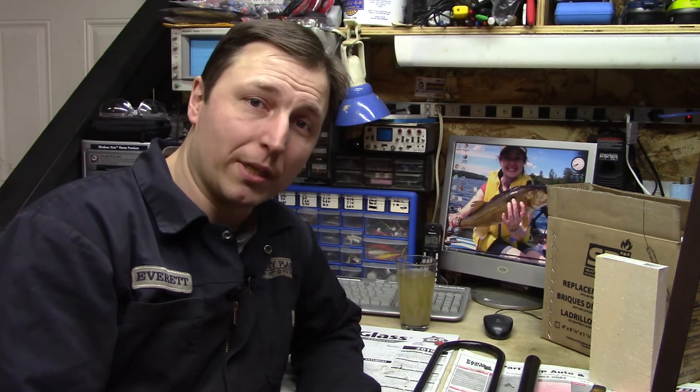I cut them apart to get the rivets and stuff out for the hinges. I've heard various theories of what they're made of. There's one place in the states, apparently down the east coast, that takes and re-rolls old railroad track, so in that case it'd probably be medium carbon steel. What we're going to do is cut sample pieces of each and harden them. Some pieces will be tempered in a kitchen oven, and we'll see what kind of hardness we get. It'd be interesting to see if they have much carbon content.